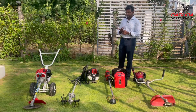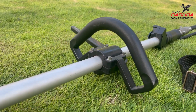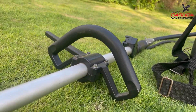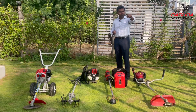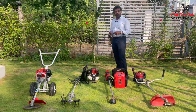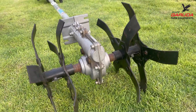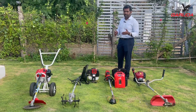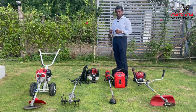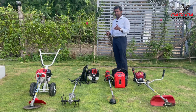The advantage of the backpack brush cutter is that it has a loop handle rather than a bicycle handlebar. The loop handle lets you cut bushes slightly above ground height — maybe three to four feet high — by pulling on it, which you can never do with a bicycle handlebar on a side pack. Another advantage is the variety of attachments: the most popular is the cultivator attachment for removing weeds, and there's also a paddy gatherer for harvesting paddy or wheat.